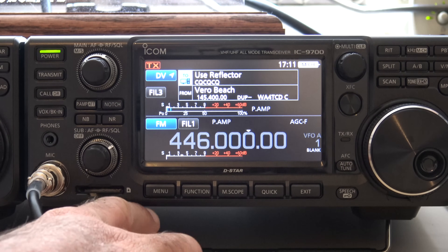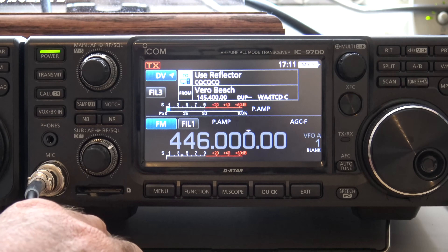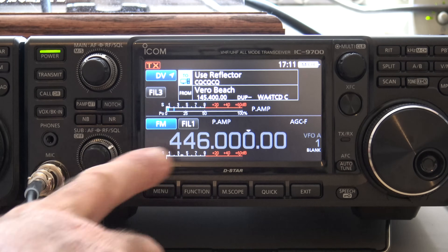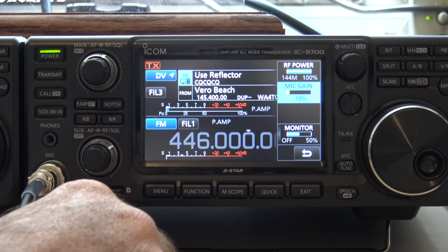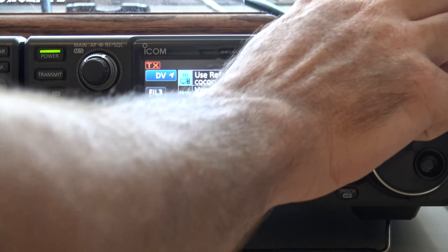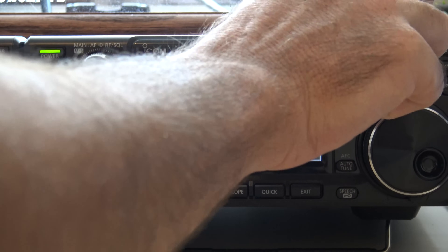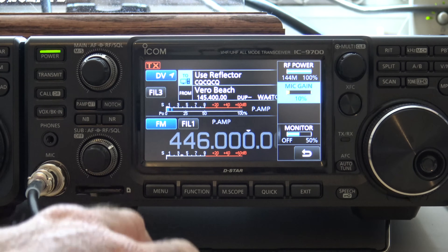One more thing I'll let you know. When you're on DSTAR, remember this: on my 7100 I ran my mic gain at 8%; on my 5100 in the vehicle I run it one bar — like four bars for mic gain. On digital, with this radio and DSTAR in general, you don't need to run more than 10%, 15%, 20% mic gain. Some people's voice — the frequency of their voice — collides with the sound of DSTAR so they sound really muddy. Other people like to run the mic gain high like they think it's going to get them more attention, but it's not. Half the time people avoid you, the other half are going to tell you you sound horrible. You don't need to use it that high. Start at 10%, ask somebody how it sounds. Especially if you're mobile, you're going to pick up every bit of background noise.